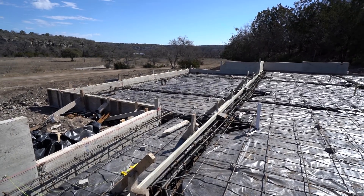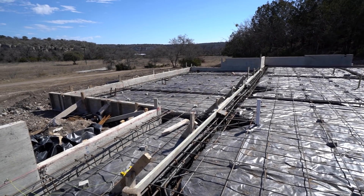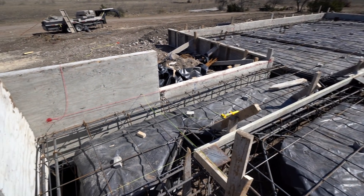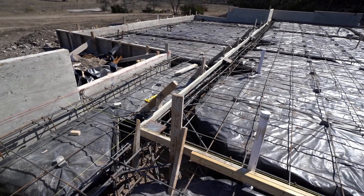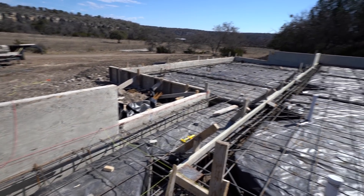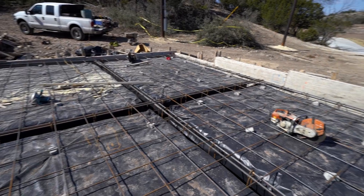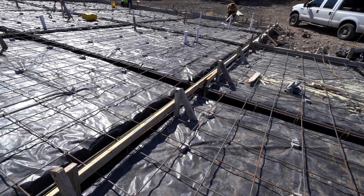You should be able to see it slope away. This one here is level; this one slopes away. We then have a sidewalk that goes from the carport — which is where I'm standing — over to the front porch, so when you park here you can walk right over. The carport here also slopes away from the house, and it's also going to have an inch and a half drop right there where that header is.